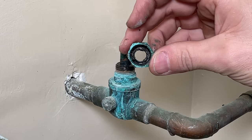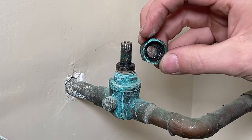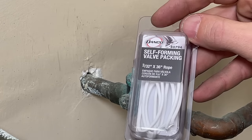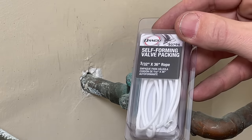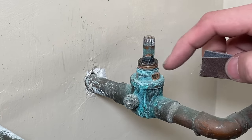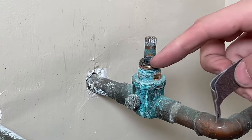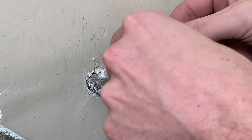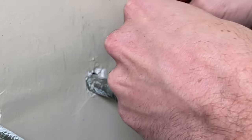I'm going to clean this up and then use some Teflon cord to rebuild that packing material. This is Teflon-based packing cord — you can get Teflon or graphite at any Ace Hardware or home improvement store, and I'll have a link to the exact product in the description. I also want to clean up the stem and get those mineral deposits off using plumber's sandpaper, which is usually used on copper when sweating joints, but here I just want to lightly work off the mineral deposits without screwing up the threads.